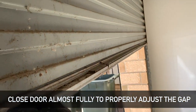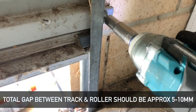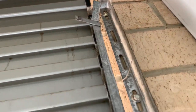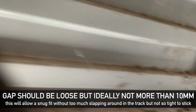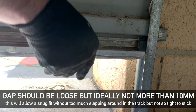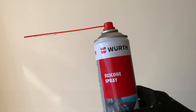Before we tighten the other track, it's best to close the door almost completely because we want to get the gapping just right. We don't want it too tight — if we have the door open it's easy to put the tracks in too tightly. So with the door up just a little way from the floor, we can get the maximum gap without going too far in or out, which is about 5 to 10mm of play. You don't want too much slapping around left to right in the track, but you also don't want it to be too tight and jam when it gets to the bottom and wear out those rollers quicker than you need to. As long as the door closes by hand nice and smoothly and doesn't jam, the gap is fine.